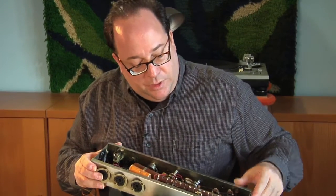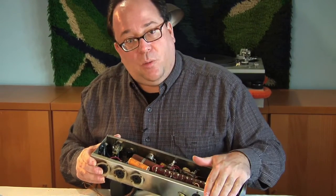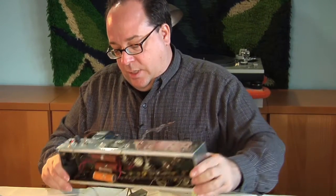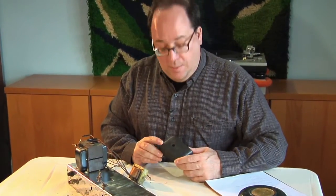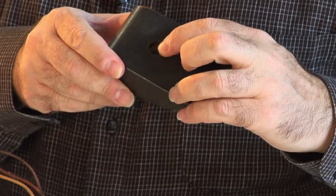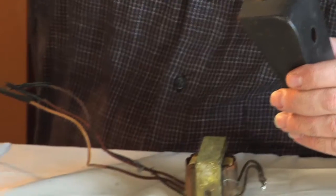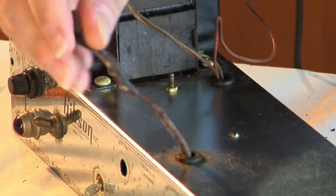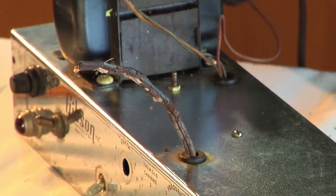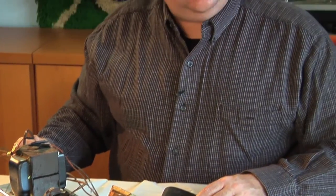In addition to all these repairs, we're going to clean all the controls and put the whole thing back together properly with all the appropriate hardware. We're also going to address its tremolo pedal, which is an interesting little carved wooden box — the switch goes here and the wire comes out here. The reason it's been disassembled is because the connecting wire is completely disintegrated; the insulation is almost completely hardened. That was also the same situation with the power cord.